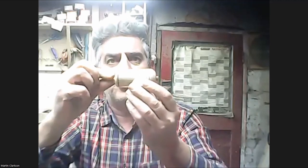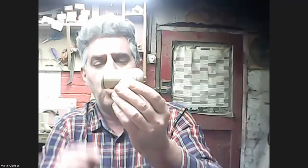So the 28mm Forstner bit comes down to that line, that black line. Then you've only got about 5mm of the 10mm bit that drills the hole through. And for those here, 28mm is 1 1/8 inch. What's 10mm? Is it 10mm? Oh, I thought you said 28. No, there's 2 holes. No, it's 28. You're right. The Forstner bit is 28mm, so 1 and whatever. And 5 is like a 1/4 inch. That's the hole at the back.